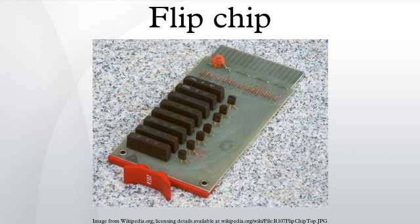The chips are then cut out of the wafer as normal. To attach the flip chip into a circuit, the chip is inverted to bring the solder dots down onto connectors on the underlying electronics or circuit board. The solder is then re-melted to produce an electrical connection, typically using a thermosonic bonding or alternatively reflow solder process. This also leaves a small space between the chip's circuitry and the underlying mounting. In most cases, an electrically insulating adhesive is then underfilled to provide a stronger mechanical connection, provide a heat bridge.